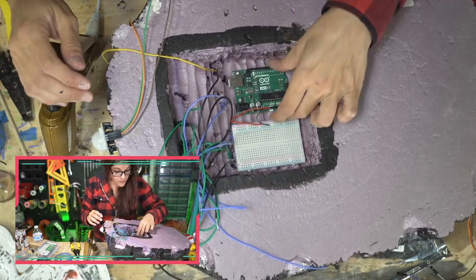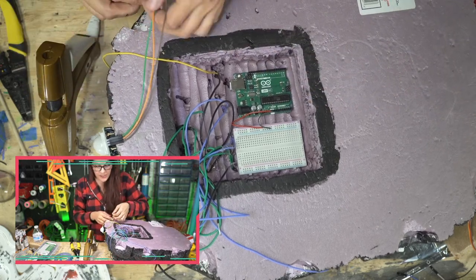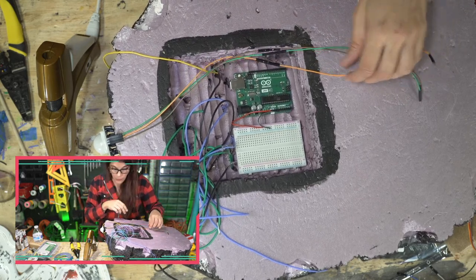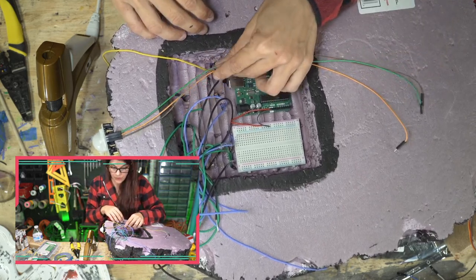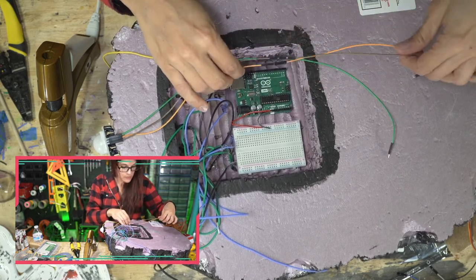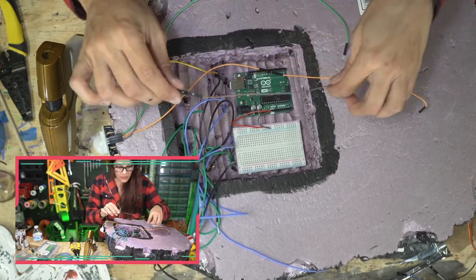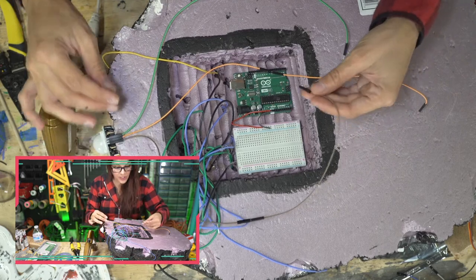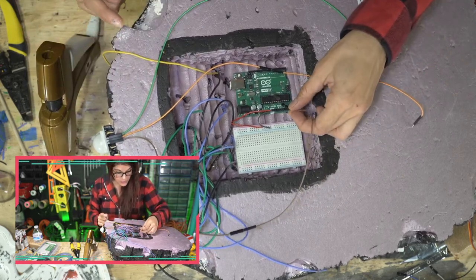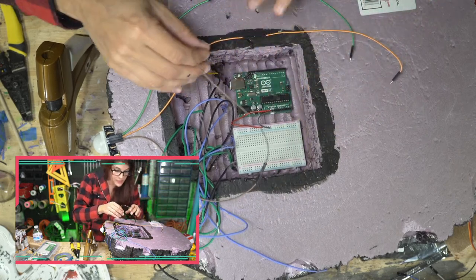So we got everything going here and the sensor. Let's wire up the sensor. And I'm trying to remember which is which. I do believe this one is definitely ground, the brown. See, this is what happens when you use kaleidoscope colors. But it looks like I kind of have it wired similarly to our servo, which usually the orange is the signal line.